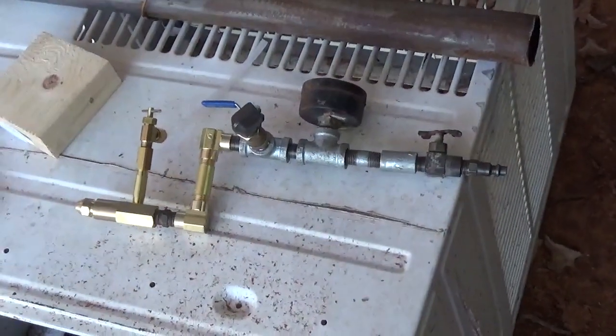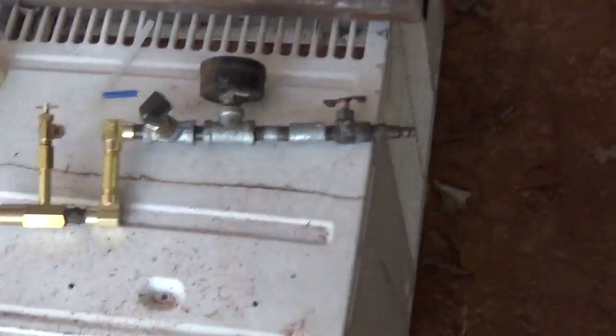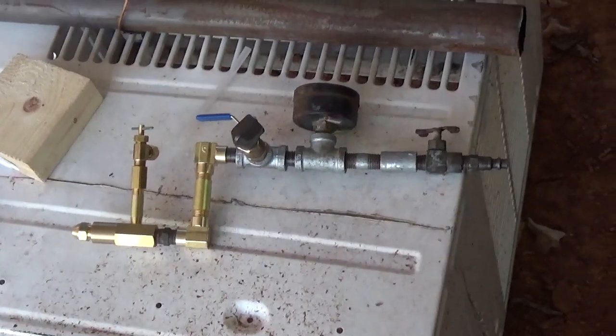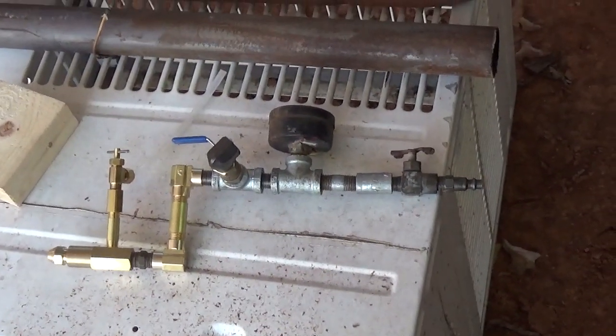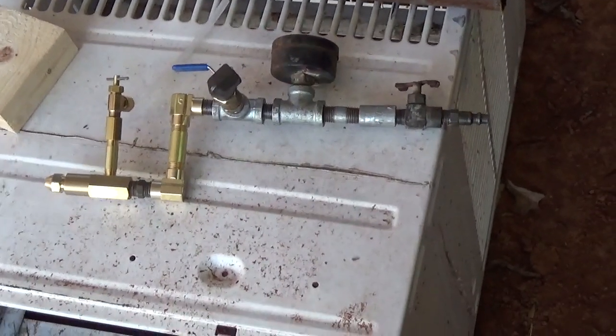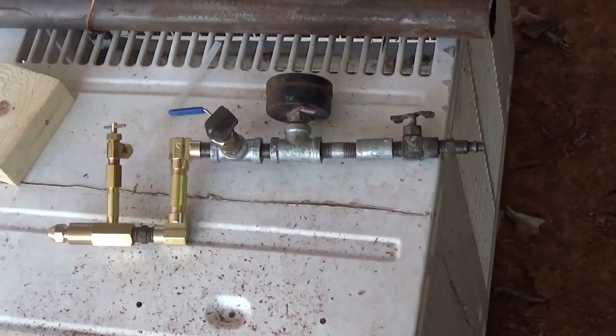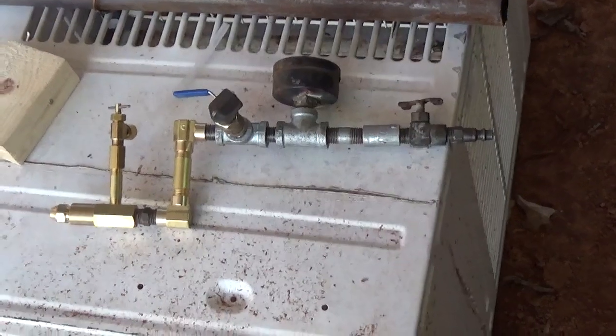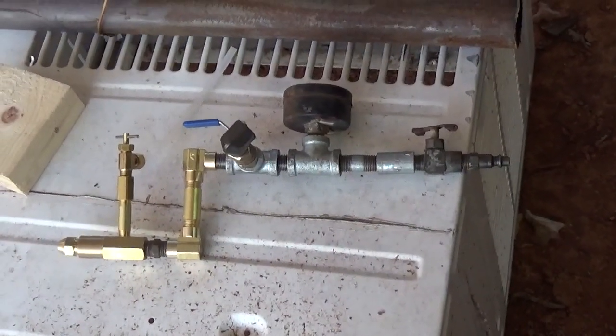When I get ready to do a test melt, we'll see how long it takes to get it lit and going. I've got a coffee filter — one of the wire basket ones — that I'm going to try to use to strain the oil. I also thought about using a little bucket pump, adapting a piece of half-inch pipe onto it, running it into an oil filter, and pumping the oil through the filter to see how that works. I don't really want to clog the tip up. I'll try to get another video out later next week for an update on this burner.